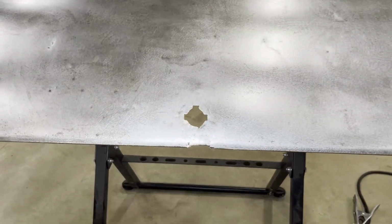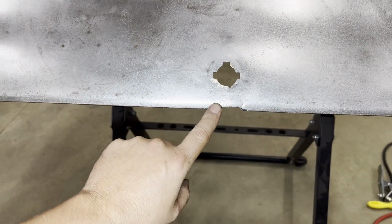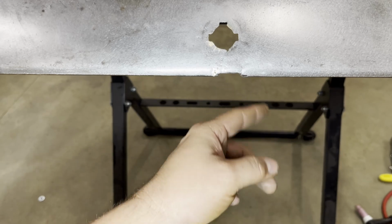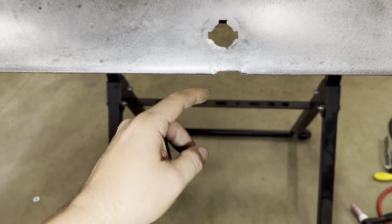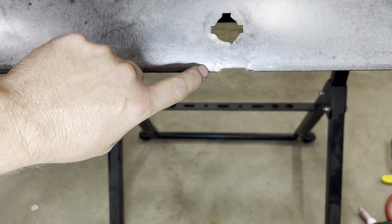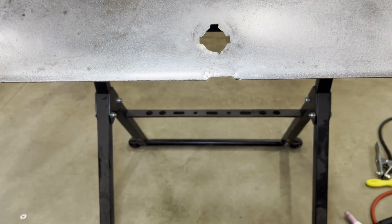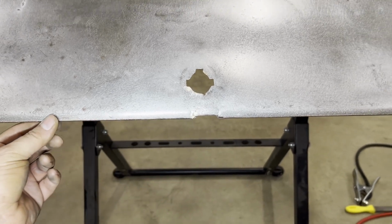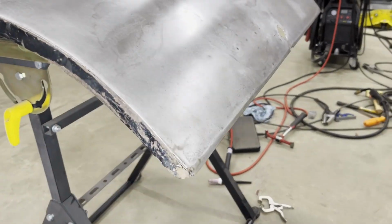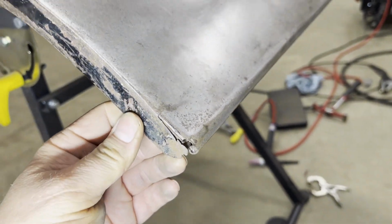All right, so here's where I'm at on this deal. I ground that brass out that was right there and it just left a crack in it. They had brazed a crack up years ago. There's a crack right here. Now with this notch cut out here and some of the inner skin missing, and with this cracked in 2 locations, I think the best thing to do would just be to cut it across, cut it down the side, and cut out all of that messed up area, bend up a new piece to go in there and weld it in. So I think that's the first thing I'll do in the next video. And then when that middle section is done, I'll come over here and fix this driver's side lower corner.